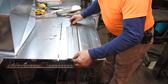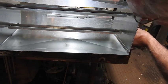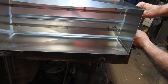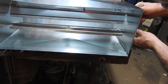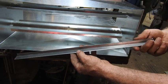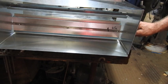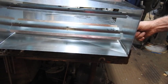Now we've bolted the shafts to the actual dampers. You can look at it in the closed position and see that clockwise to open unlocks and allows air passage. You can see a little bit of daylight at the very bottom and the very top — we're not concerned about the sides, but the top and bottom I'll show you how we solve that. There's a miniature bend that's going to be riveted to the duct, and when the damper latches down it'll come in contact and hold position — one on the bottom and one on the top — blocking probably 95% of the airflow.